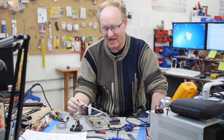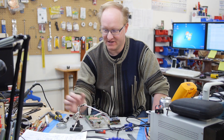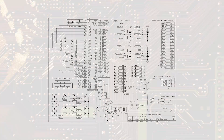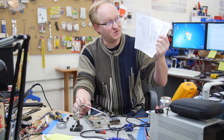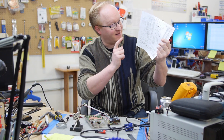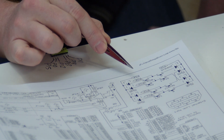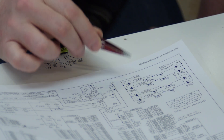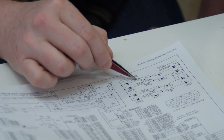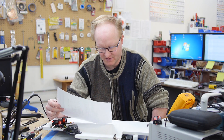Now it's time to wire up the controller to the Game Boy. I've attached a ribbon cable to the spots on the old ribbon cable where the controls were, and connected it to a disconnect. The schematic shows a kind of multiplexer driving the switches. I'll attach this header to the back of the switchboard and add diodes according to the schematic. There's P11, P12, P13, and P10 — those are probably the drivers. They send a signal to both switches; if a switch is pressed it goes through the diode to P14, so you activate them in sequence and see which is active to determine which button was pressed. A shift register would have been easier.